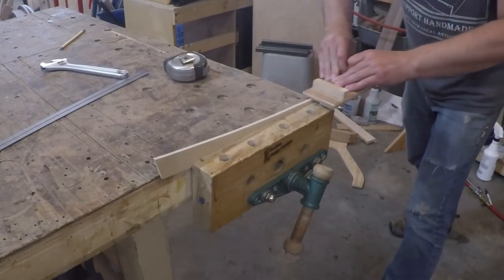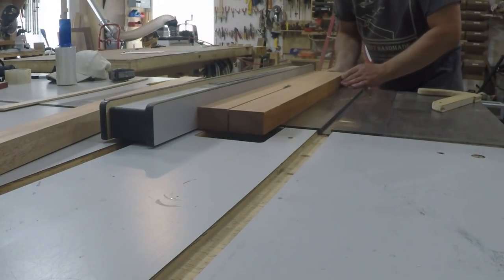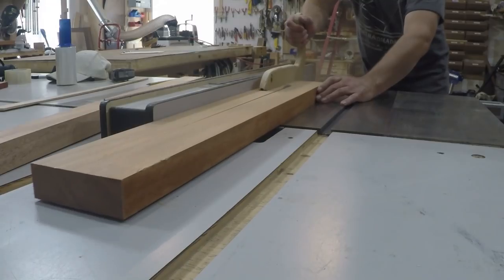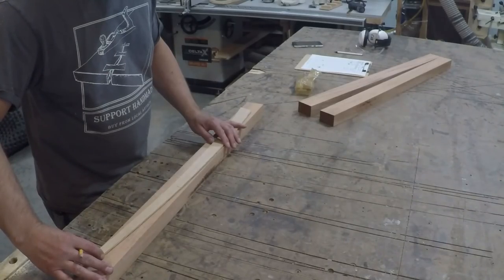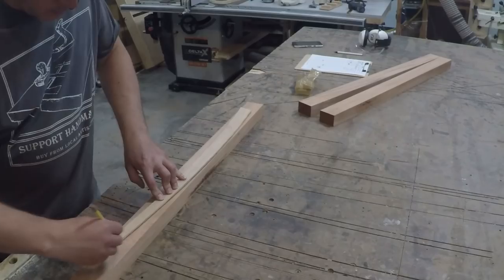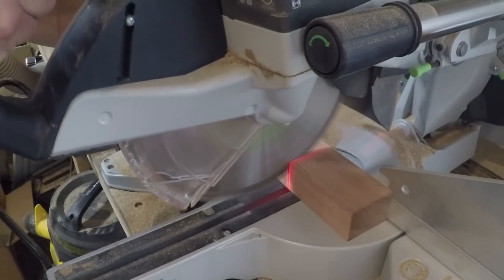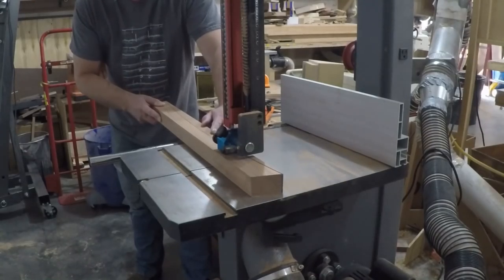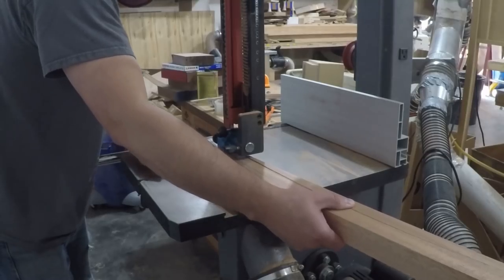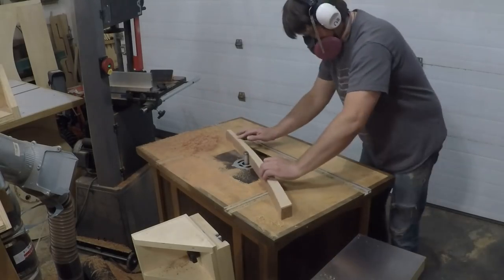The final fairing of the curves was done by hand at the bench. I milled up some wood for the legs and ripped them to rough width at the table saw. Using my plywood templates I traced the leg shape onto the blanks, making note of the grain direction to have fewer problems with tear out when shaping. I used the same laser technique to cut the legs to length at the right angles, then cleaned them up at the band saw. I taped the template back on and with a flush trim bit at the router table I cleaned them all up.